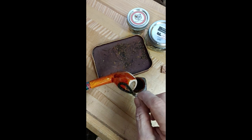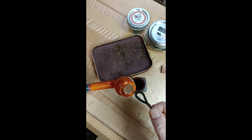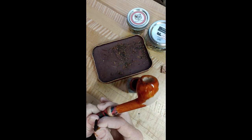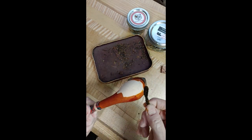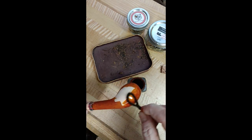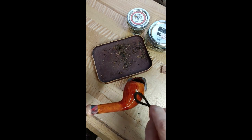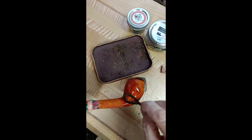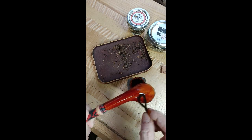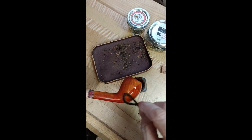I am going to go ahead and dye the remaining plateau. It's just too hard to knot. I think it'll look fine this way. Now I can see already that this briar is picking up the dye and it's laying it heavily into the softer grain. I have to go over this a bunch of times because it takes a bit for it to even out, flatten properly.